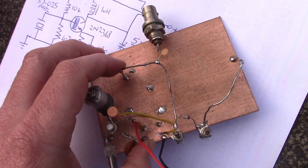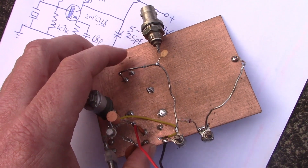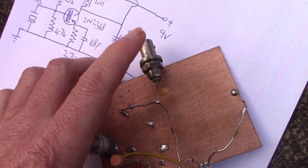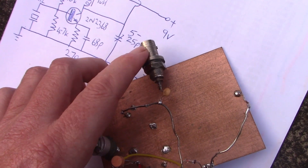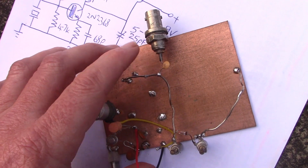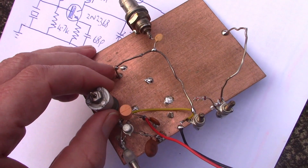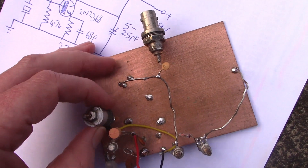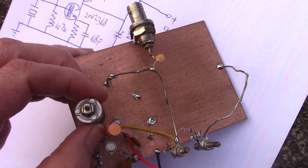The mixer is entirely passive — there's no RF amplification. So as far as an antenna goes, don't just use a piece of wire a quarter wavelength long. It might work, but I suggest an outdoor antenna at home. Not the highest of sensitivity, but as you'll hear, it does work. If you've got a FM repeater output — the one here is about 10 kilometres away — it might have a range of maybe 15 to 20 kilometres. You certainly wouldn't use this for long distance reception.